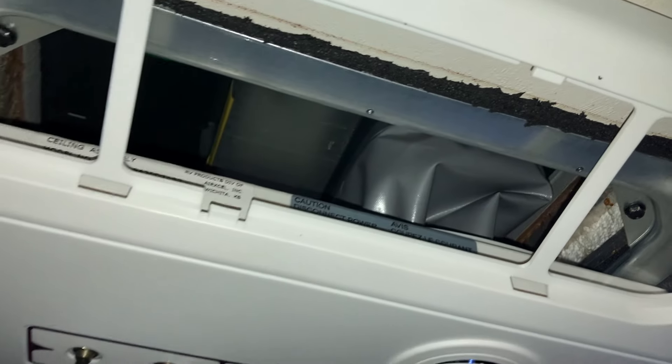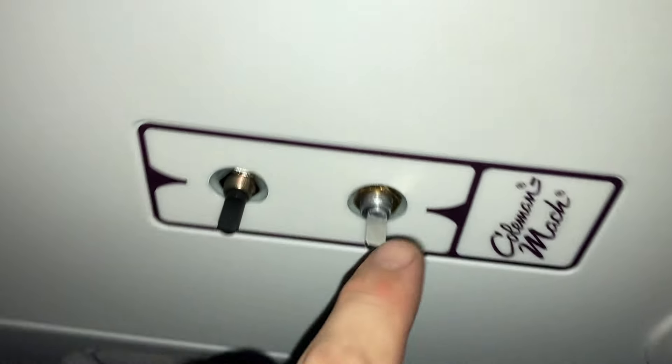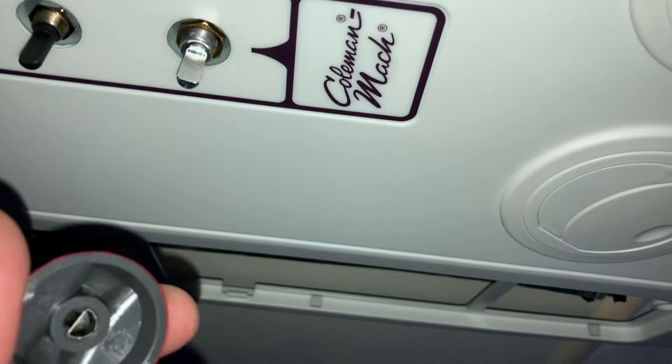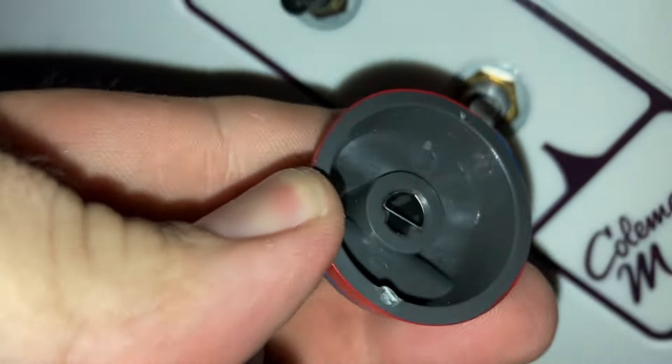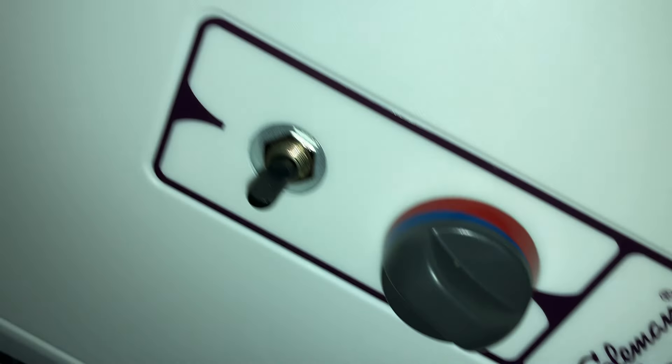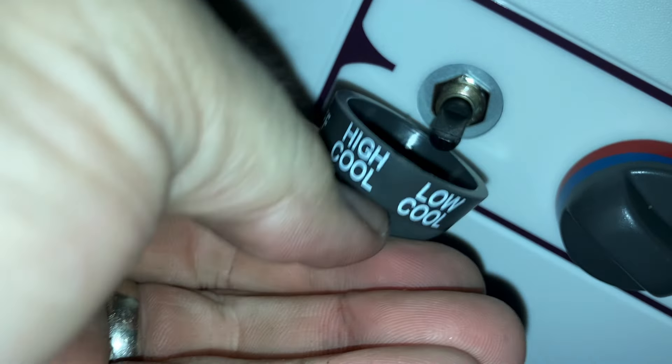The shroud's on. To give you an idea — since I still have to run the wiring — now that we've got the shroud on, you go ahead and put your dials in. This first one that's chrome is going to be your thermostat. It's only one direction — it's like a half moon. So you just put the half moon like that on this switch right here. And then this is your selector for high, low, medium, cool, fan — same thing, put your little half moon there.